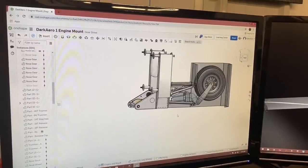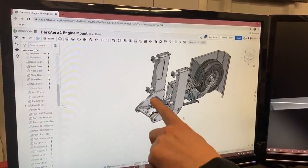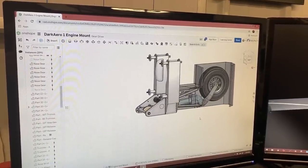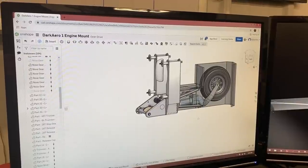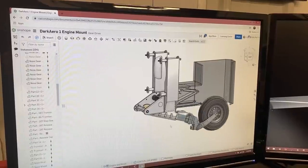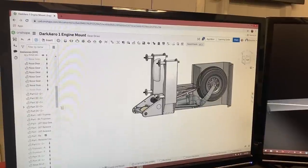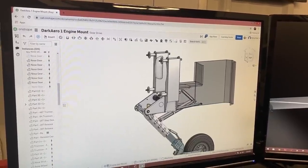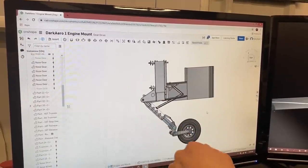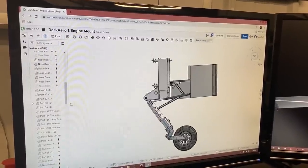When you go to extend the gear, if you ever had an electrical system failure or the motor that retracts it right here were to fail, we have a backup system. For the pilot, you just pull a simple T-handle in the cockpit that unlocks the gear and disengages the motor from the rest of the gear drivetrain that drives the strut. So the gear would start to fall down under gravity. Gravity naturally wants to pull the gear down like this, but because it's hinging forward, aerodynamic forces start to counteract that gravity load, and it would naturally reach an equilibrium position around maybe 45 degrees like this.